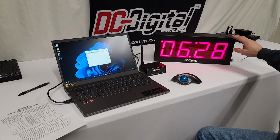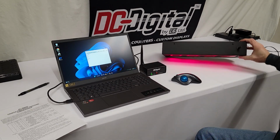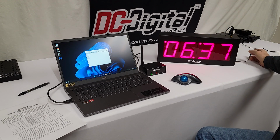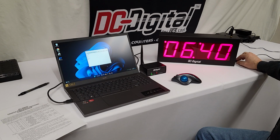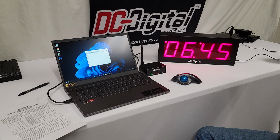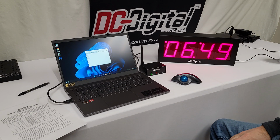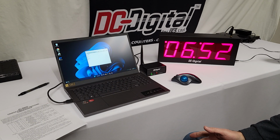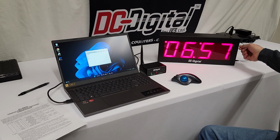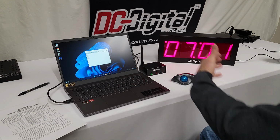This one is 4-inch high, in an aluminum enclosure. You mount it either on a 4-square or handy box, or just with two screws on the wall. This is a 120 volt unit with a 6-foot cord that plugs in the side here. We do offer PoE; you can use PoE to operate it and also power it. And we do have network also. If you do a network drop, you can do it through your network also.